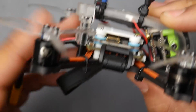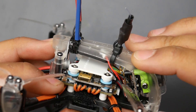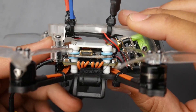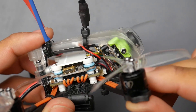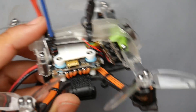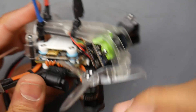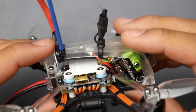The ESC and flight controller are the Mamba Mini stack. I've noise-tested that stack and it tested absolutely phenomenal. The amount of filtration it has on board for a 20x20 stack is remarkable — you could even get away with using larger 2205 motors on it, so handling 11xx motors will be flawless in terms of electrical noise. There's also a capacitor mounted onto the ESC, which is a really nice addition.